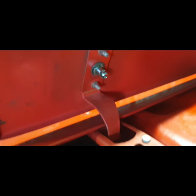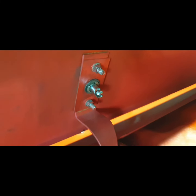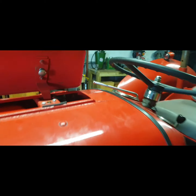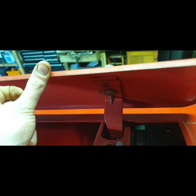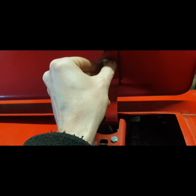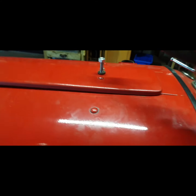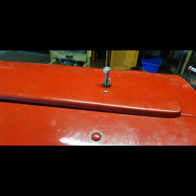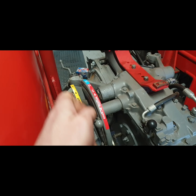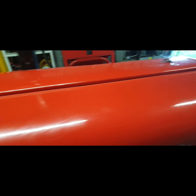I obviously have to do a little bit of work on this one here as well because the circlip wasn't going into the slot, so that's the plan with this side too — just stop them from falling off in the future. A flare is the way to do it without using hammers; you just keep turning the square edge a little bit more and tightening, then get your plastic hammer and tap it back out, turn it a bit more, tighten it up and you'll feel it flaring. I fitted the stickers for the draft and position control as well.